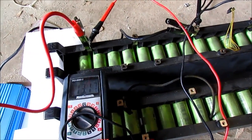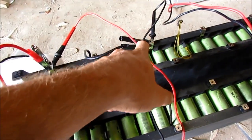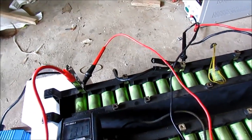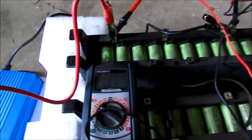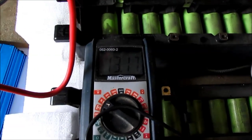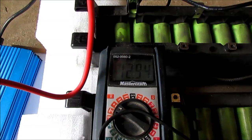Not 100% sure, but I've got one, two, three, four cells in series to make 13.17 volts on this pack. We're going to see how well it takes a 300 watt load — which is 30 amps through this 12 volt inverter — and see how well it takes the current and how much voltage drop we get.